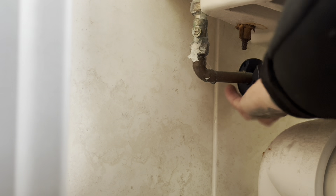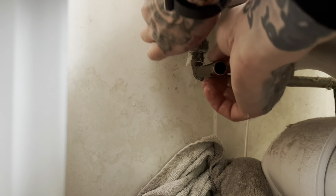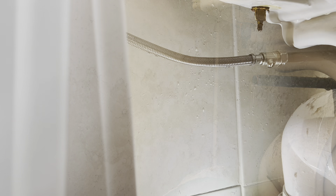Torbeck. Obviously I've still got the water off from changing the tap downstairs. I'm going to cut this off out of the way. There's a little bit of dregs left - that's why you always have a towel. The washer's gone in that. We're replacing it with the Fluidmaster Brass Shank. Customer supplied this - the reason why I've got this job is because he works at the merchants, hence why I've not supplied anything.